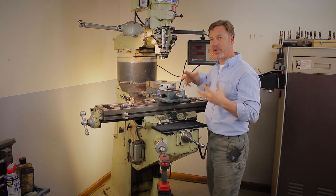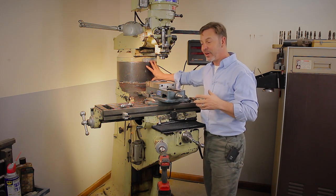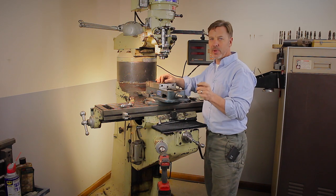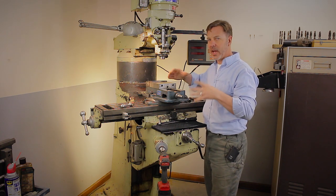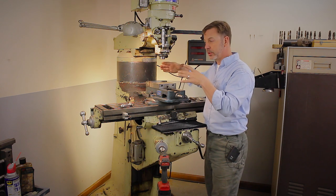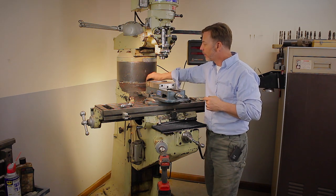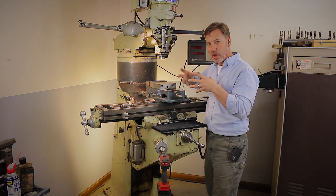I've also been asked, could you build one of these? And the answer is yes — they're not difficult. You'd have to measure your mill; I think this one is about 14 inches in diameter. If you've got a good, thick, rigid piece of pipe, I'd want something with a minimum of three-quarters of an inch thick, maybe one inch if you can. And even if your lathe cannot handle something that big to mill both ends, you can do that all on the milling machine by building a special large fly cutter to reach out and get that larger diameter. The way you would set it up is, this has to fit inside a groove, and then it has a male and female connection. You'd be able to take the head off, measure it, match it up, and bring it all together. It wouldn't be that hard a project.